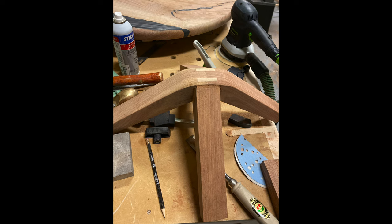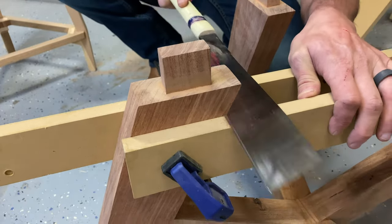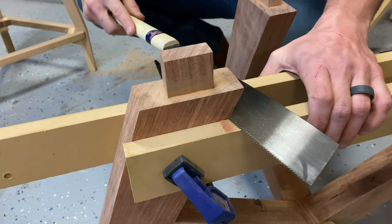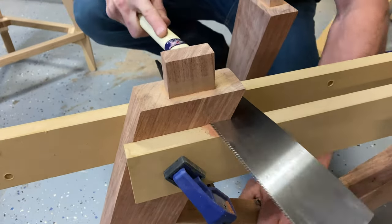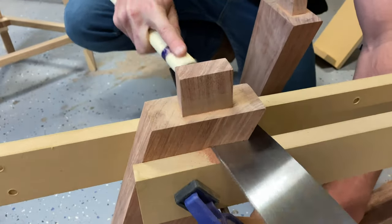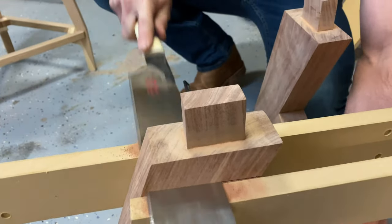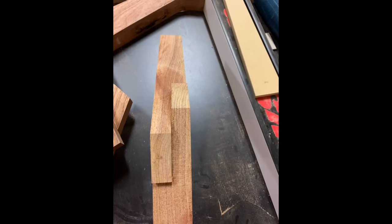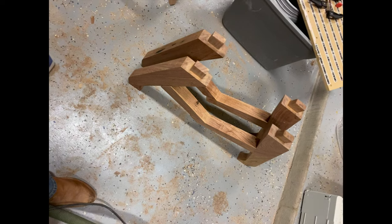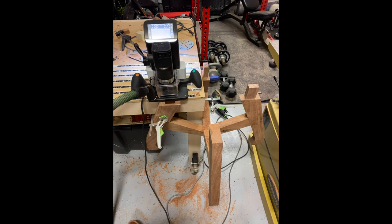That was very frustrating because I'd spent about two to three days on that base. You can see right here it was already going, and when the leg started wobbling, my joint just wasn't the strongest and it came apart. I had also somehow made this base two inches too long — something went wrong going from the iPad app to the Shaper app. So on the second base I got the legs the right length and went with a half lap to connect them, then half lapped again to put it together.